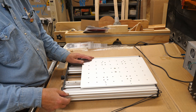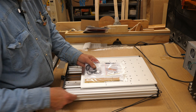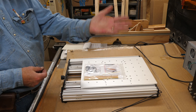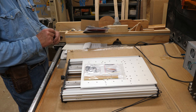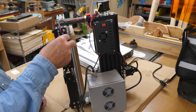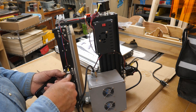So we've got this laid out. What I'll need to do is remove the old bed and put this new one on. They give you a little gauge here to space the T-nuts, which are already in there. It'll be pretty much a disassembly and then reassembling the base like I did when I first got it. I do believe I need to move the Y-axis motor over as well. So I'm going to need to remove the X-axis stepper motor and wiring, and take off all the little cable clamps.